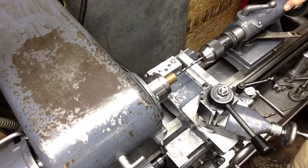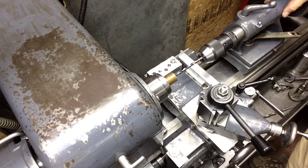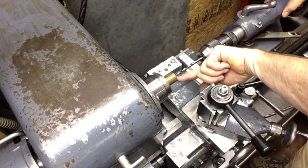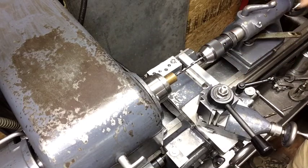So we're going to drill it, then we'll be tapping partway. We'll make a couple and cut them off, tap it some more as we go along. So I'm going to drill this out to a letter Q, .332, for 3¼ inches. We'll get started on it.